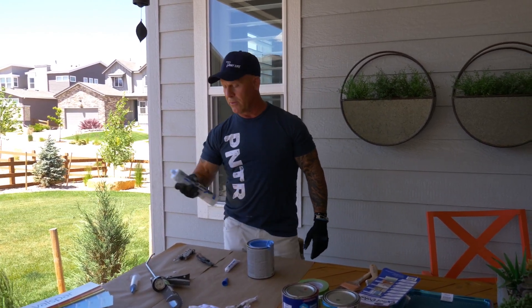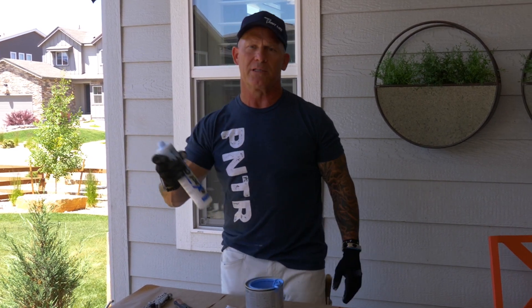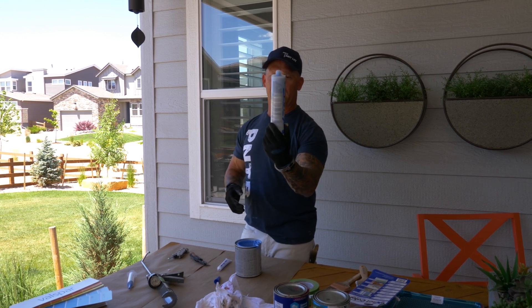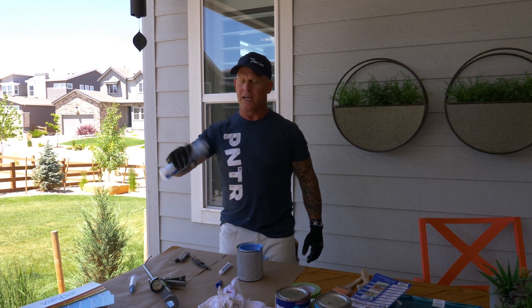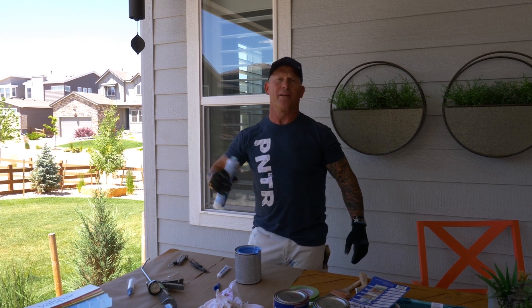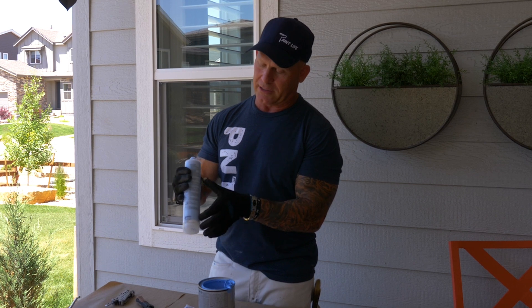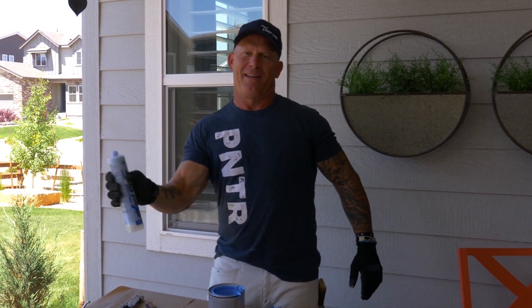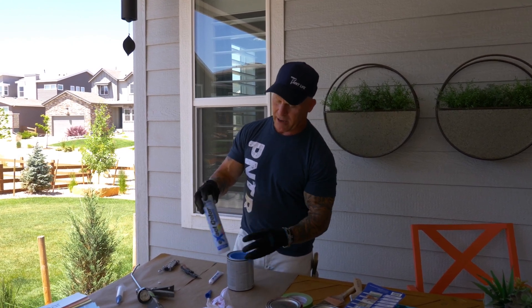This is very simple and easy — professional painter, do-it-yourselfer, anybody can do this. What this does is save you from having to buy all different colors of caulking, because even with all the options available you're not going to get an exact match. After 30 seconds of shaking it's not quite mixed, so instead of shaking up and down, agitate it back and forth with a bit more muscle. I've even heard you can use a sawzall. Now I can see the blue going all the way down — no more white. Color is mixed throughout. Nice. Verify the color is mixed throughout before removing the lid.